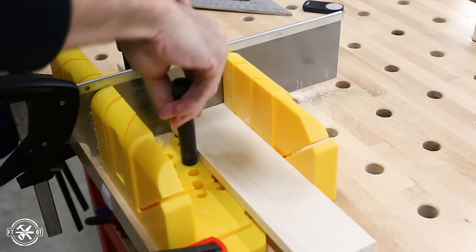The ends of the spice rack were left pretty ragged from the handsaw cuts so I smoothed everything out with a 100 grit sanding block. This is a great example of where having a random orbital sander would come in handy — they're a cheap investment for the time they save you and the better finish you'll get versus doing it by hand. I finished up the spice rack with water-based poly, and in standard cabinets it's going to fit four of those smaller rectangular spice cans perfectly. And a wise man once said, having your spices organized is the key to happiness in life — pretty sage advice if you ask me.